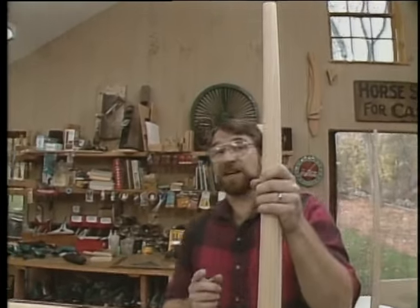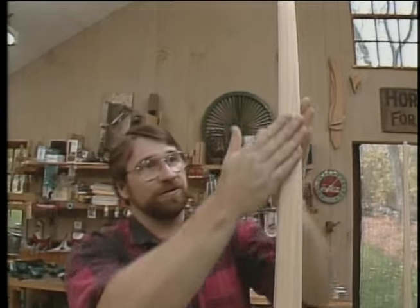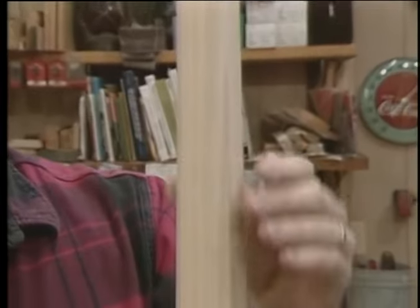The choice of materials was a little difficult. At first I thought I would use pine, but pine sometimes can be unstable and I didn't want a post that would twist. So I chose poplar, a favorite among woodworkers, because it mills nicely, takes paint very well, and it'll stay stable. Now the real challenge in this project is how to make this tapered post — it's tapered on four sides and then beveled on the corners, giving a very elegant and thin post. To do that, I made myself a jig.